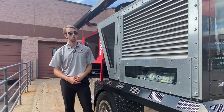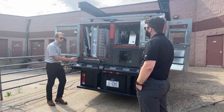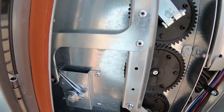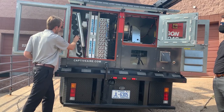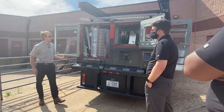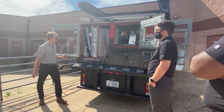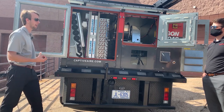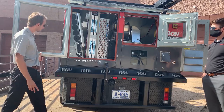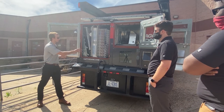We'll move over to the cooling coils and the components that go into processing the air. The first thing our air encounters when it comes through is our outside air damper — a geared mechanism with no play or slop. This damper is not going to move on us, unlike the slop a traditional RTU has on its economizer damper. Building balance is important, and knowing how much air we're bringing in is critical. It exceeds Class 1A leakage standards, so it exceeds all current energy code requirements.